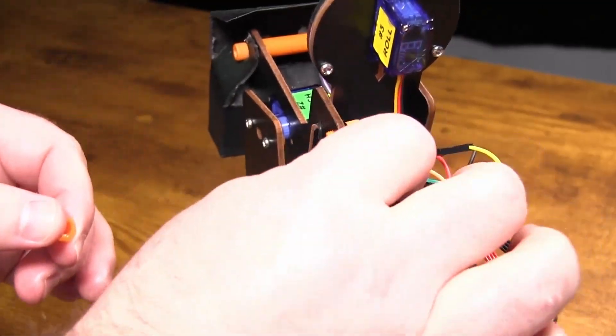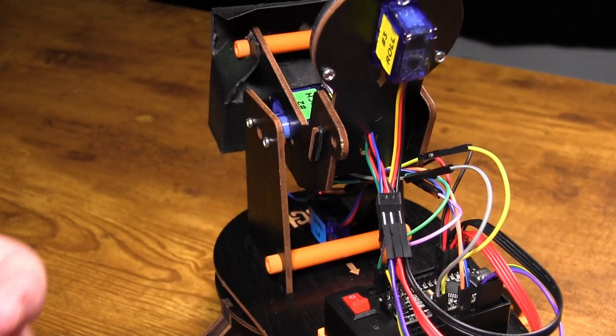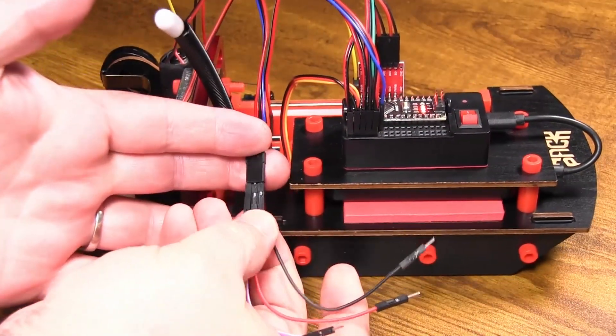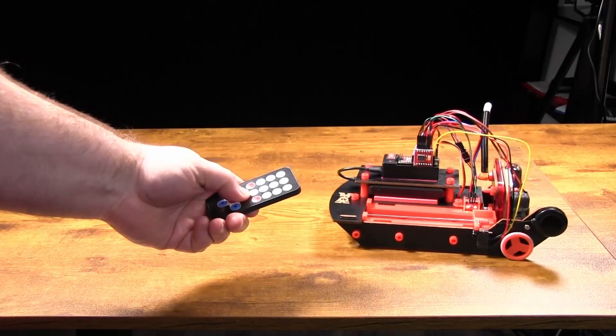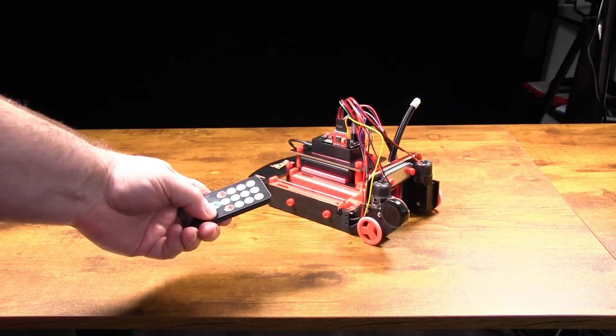The fourth chunk of code uses the IR remote. This IR remote is from your IR turret — you take the receiver from your IR turret, disconnect it, and connect it to your Domino Robot. You'll probably need some jumper wires unless you want to sabotage your IR turret. Connect the two power wires and one pin wire to the right spot on your Domino Robot, and it will drive left, right, back, and forward based on your remote signals.